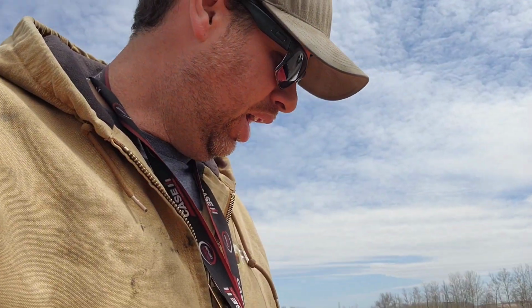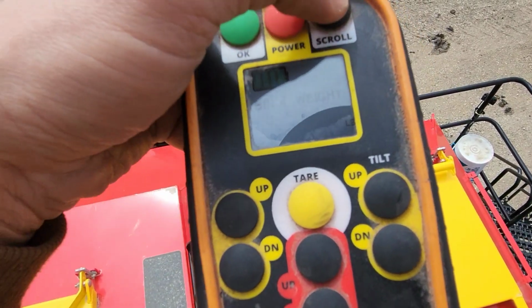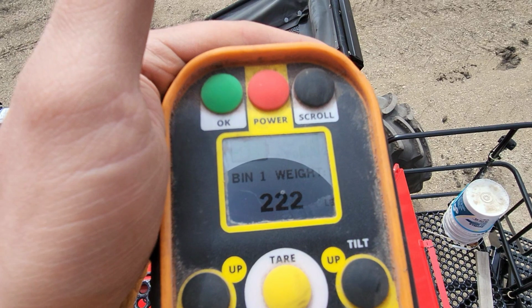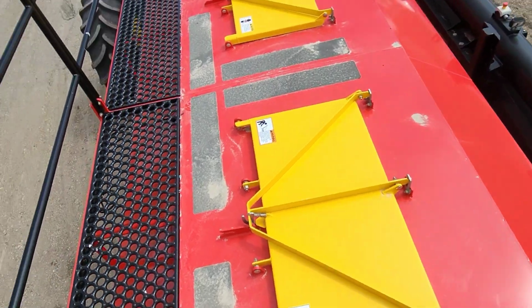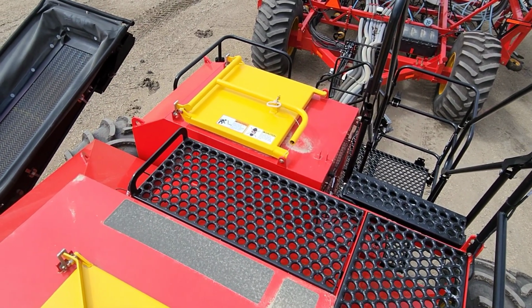So we're going to do some troubleshooting here. Dad's actually ran to use the bathroom scale just so we can scale out others. I suspect we might have a bad load cell on that tank, being that it's showing that we are essentially 30% light. Bin 1 has the most sensitive one, so I'm gonna stand on it. Probably be about 240. I weigh more than 215, I know that for sure. And I'm wearing boots. Anyways, let's just say it's 200 pounds, because that's the most accurate. It's got smaller load cells.